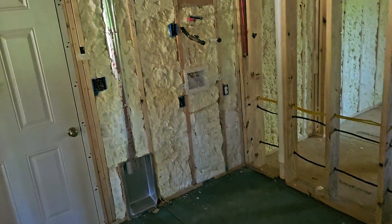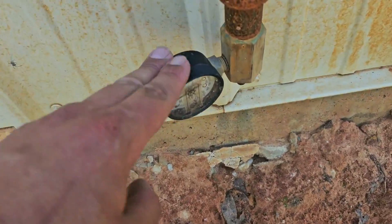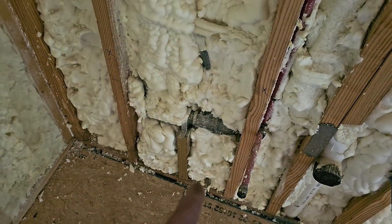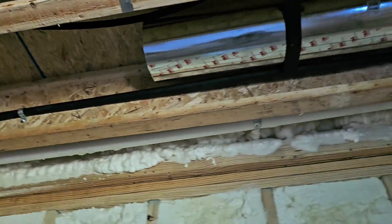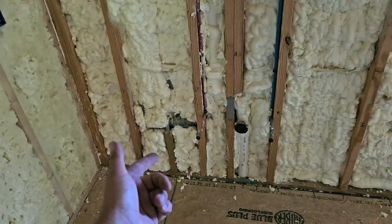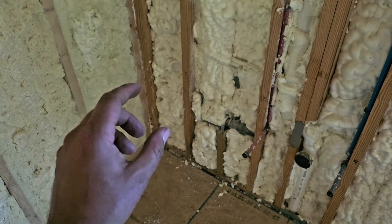Let me show you something outside you have to do for your gas lines. The propane tank is going to be out here somewhere. You want to make sure that you get a pressure gauge so you can put pressure on your lines and pressure test them to make sure you don't have any leaks. Here's the gas line on the other side of the wall where it comes in, and you can see that track pipe running up inside the joist. Make sure you check with local codes because you may not be able to leave a connection inside the wall — you may need some type of access cover. Also check if you can use track pipe, because some local codes require hard black iron pipe and do not allow flexible track pipe.